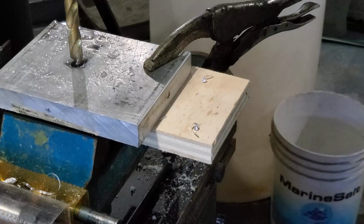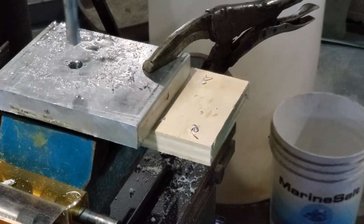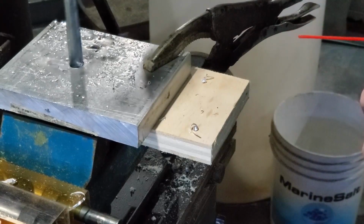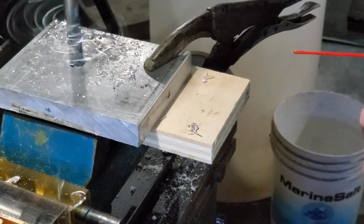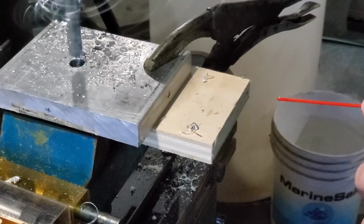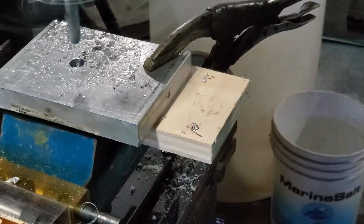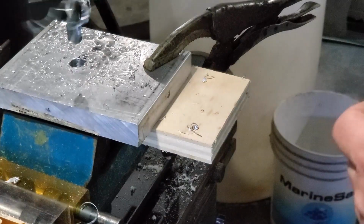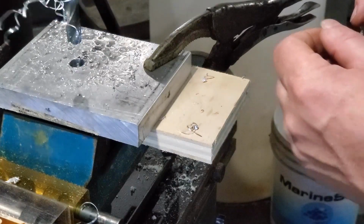I think I have a couple that are just slightly more. So I really do need a couple that are somewhere between 3/4 and then probably 1/8 bigger and 1/8 smaller as well to make this a little bit better. Because when I went up to the 15/16 and tried to drill the rest of this big chunk of aluminum, there was just way too much chatter.